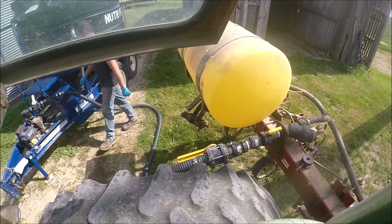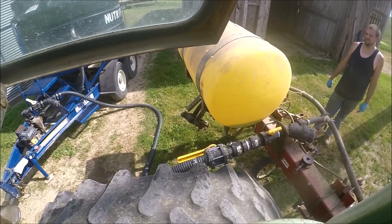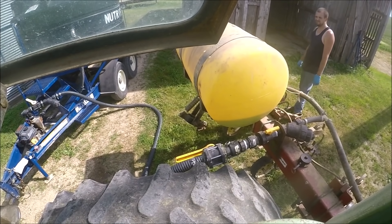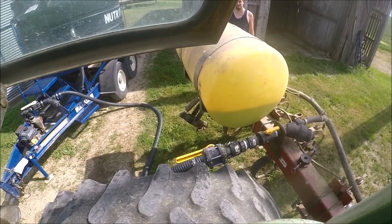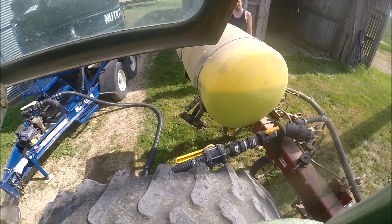The biggest issue I had with this cultivator in regards to the fertilizer is the check valve worked. But the problem is I wasn't able to feed it out onto the ground or next to the plants fast enough, so the fertilizer was transferring from this tank over to the tank on the left side of the tractor. And that little check valve I put in was doing its job — it wasn't letting it come back, which is exactly what I wanted.